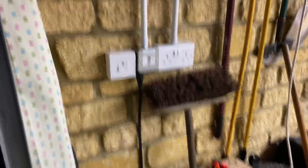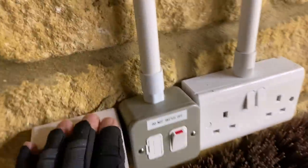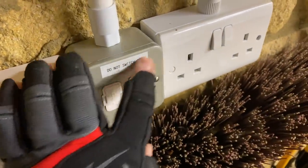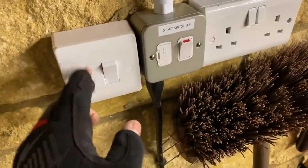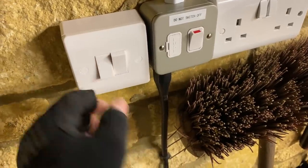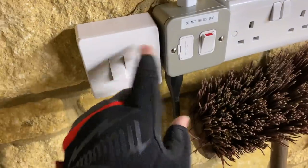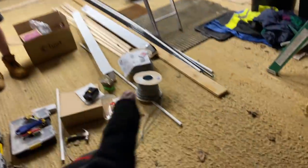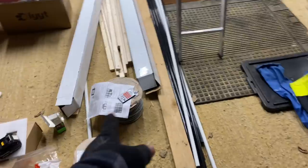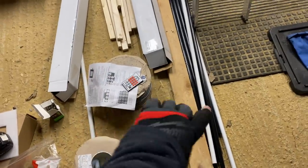The microwave sensor works - James has been playing with the buttons. The client will be happy with that. We're labeling up: switched fuse for now but probably changing to unswitched with a 3-amp fuse. Controls labeled - garage lights and flood. I'm really impressed with the microwave sensor ones - the remote control is much nicer than fiddling under a PIR. Eight-metre detection distance on that one.